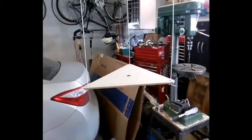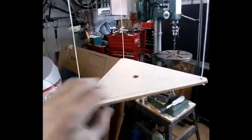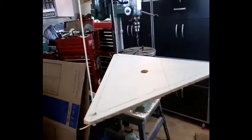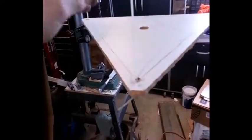Here is my platform for measuring the moment of inertia. It's bolted to the ceiling as an equilateral triangle with string — actually weed whacker wire — coming down, and it's level. The first measurement is the platform alone. You give it a slight rotation and let it oscillate. Here I'm counting: one, two, three, four, five, six, seven, eight, nine, ten oscillations.